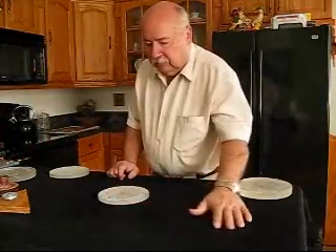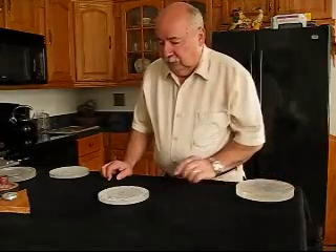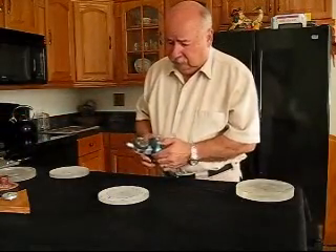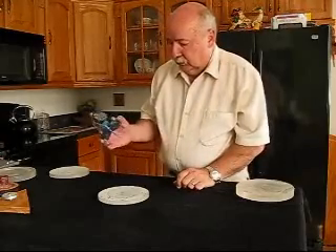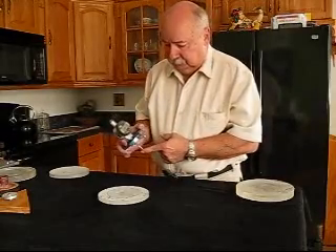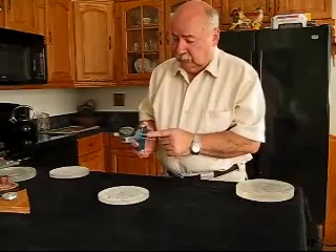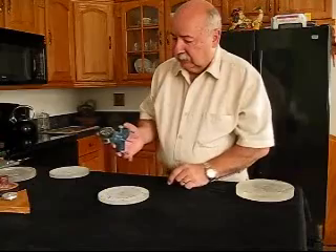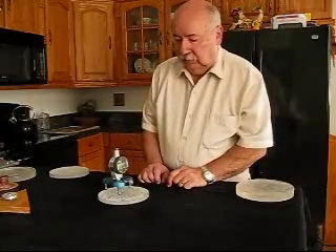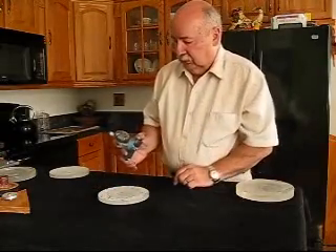Working refractor lenses — or other lenses — usually to a prescription requires a lot finer control of radius. So you may need to make a better spherometer. This is one that I made. This is a digital indicator — it goes down to micron sensitivity. These are just screws with sapphire balls glued into them, and it's a sapphire tip. Again, you zero this off on flat glass. There are programs you can get for using these. For larger sizes as well, you'll probably want a larger base — it's the same idea.